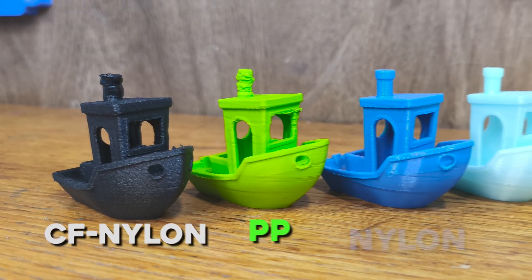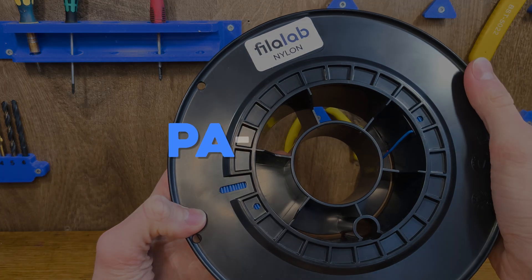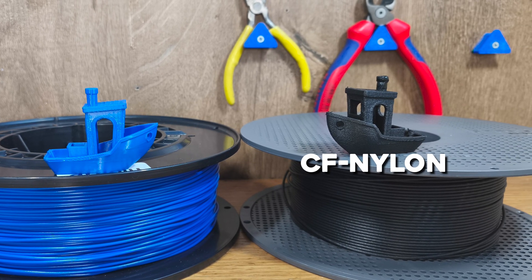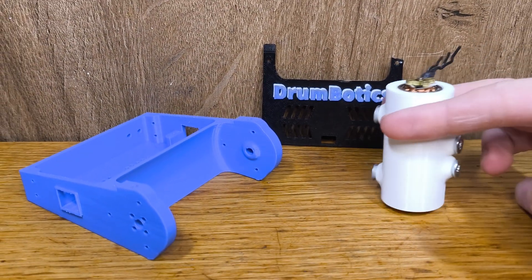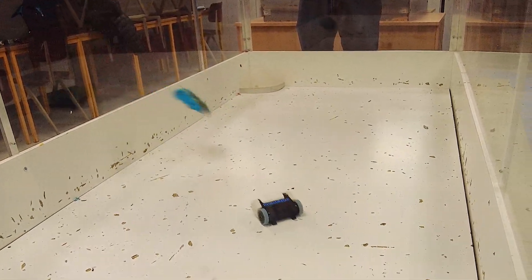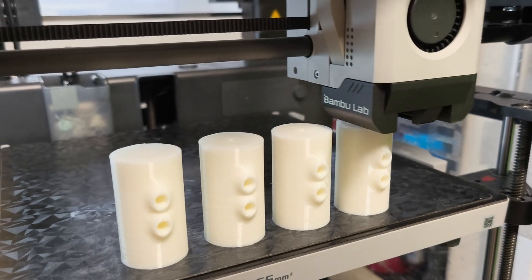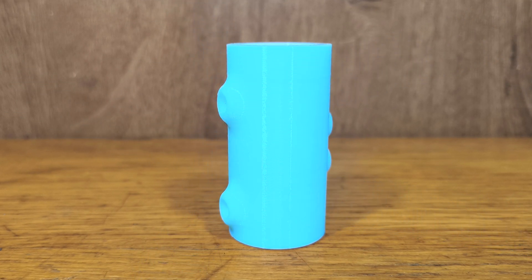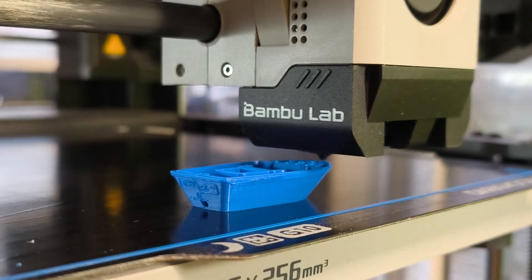Nylon. From my personal experience with filaments, nylon performed the best. This is a basic PA 6-12, which is way tougher than, for example, carbon fiber nylon. It's not a rubbery plastic and it feels more like ABS. Nylon works for printing frames, top plates, or even weapons — it can absorb a hit and survive. But here's the important part: after you print it, nylon needs to sit for a bit and absorb some moisture, as it's very water absorbent. A part that was sitting for a week absorbing moisture will handle impacts way better than a freshly printed one.